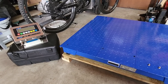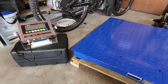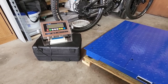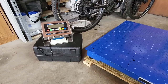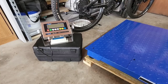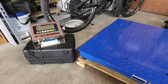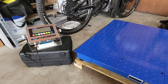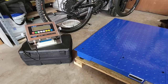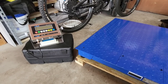What you're looking at is really a combination of things. Over here on the left is the display, or indicator. This specific one is called the SL7510 SSC12, which is a full stainless steel washdown-capable indicator rated for IP68. Basically this thing is designed so you can spray it down if you get anything on it. They also make versions designed for intrinsically safe environments — equipment that won't create a spark that could cause an explosion.